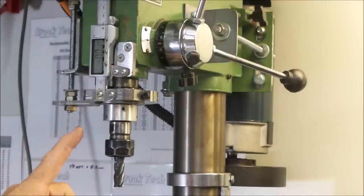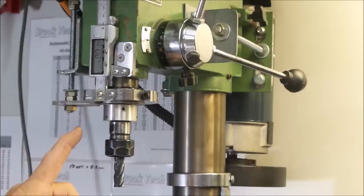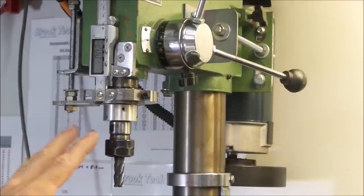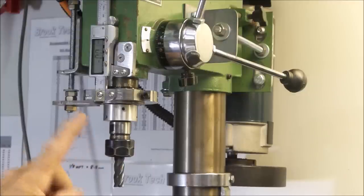It's merely a piece of 6061 round stock with a hole either side to match the spindle insert diameter on one side and the spindle nose diameter on the other. Then there are 3 4mm grub screws locking either side to the respective part. I've used this setup for many years with no dropouts. I've also tested it without the collar, and the spindle drops out often, and I would in no way be confident to use this setup without that collar.